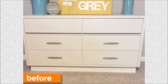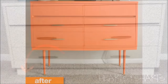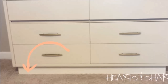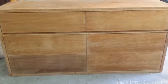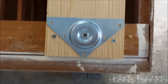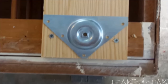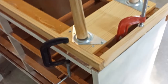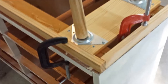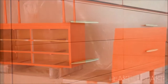Project 2: DIY a vintage dresser that goes from white to wow. Start by removing the bottom trim on the dresser and then strip off the paint using a Clean Strip Premium Stripper. Spray it with a spray primer and let it cure for a few days. Add a couple of 1x4s to the dresser and attach the leg brackets to the wood. Next, add 16-inch legs from Home Depot to the bracket. Add a couple of 1x2s around the edge as trim to hide the wood supports. Paint the dresser red and after 2 weeks of drying time, this is the result.